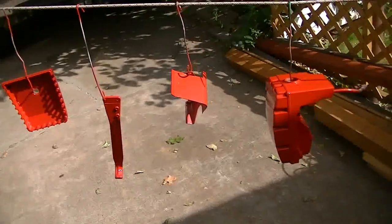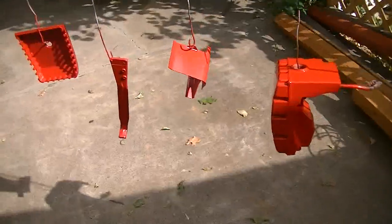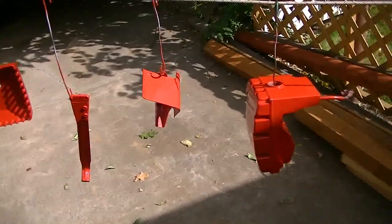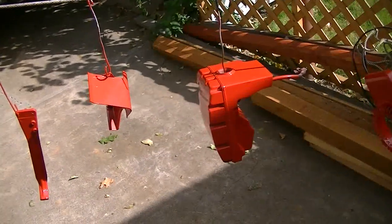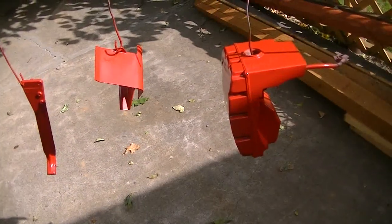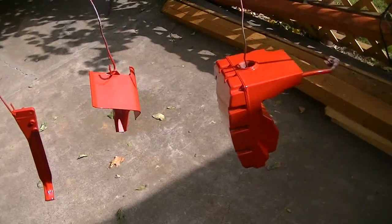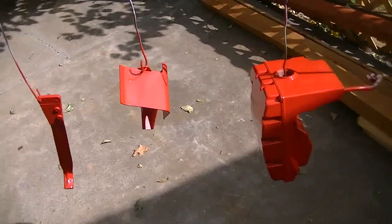You definitely want to pay attention to those dry times. The paint I'm using right now is the Duplicolor Engine Enamel — this is Chrysler Red, and with a clear coat on it, it makes it almost identical to a good many new old stock parts that I've got that are Homelite Red. It's a little more orange than the late model powder coat and a little less orange than some of the real early saws, but for the bulk of the 60s through the 80s, this matches almost perfectly. You could use it as touch-up and it would look pretty good.